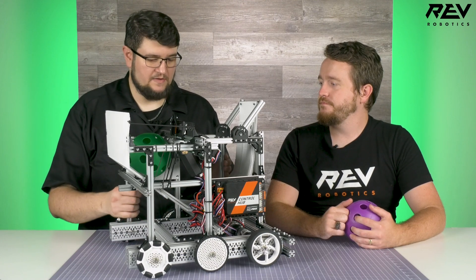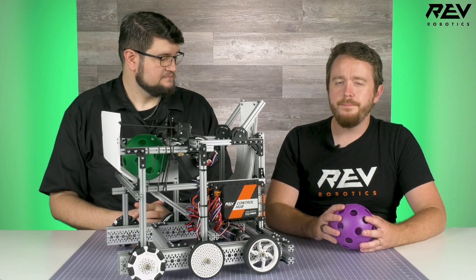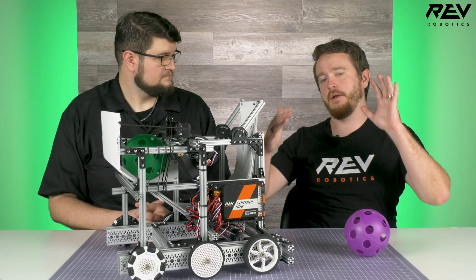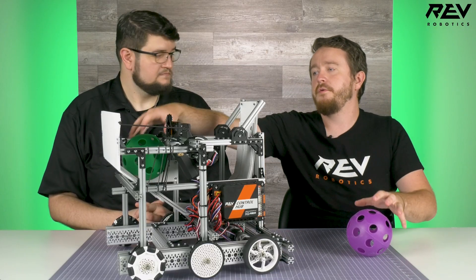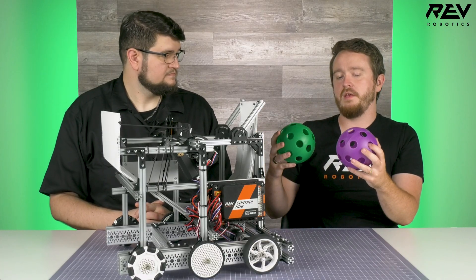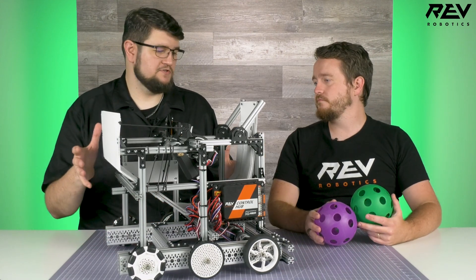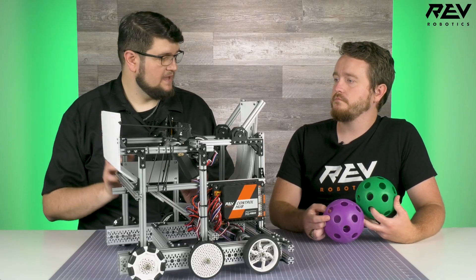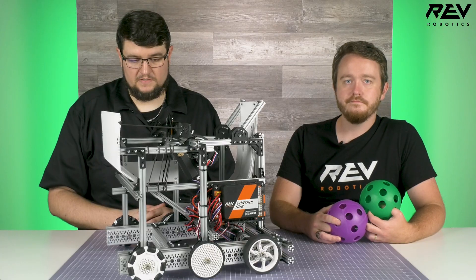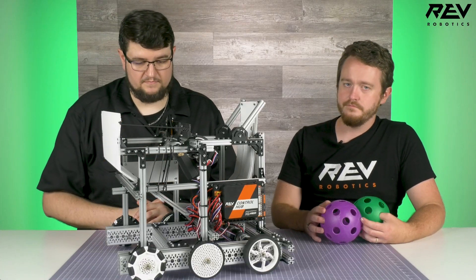The biggest challenge when building this was serializing the game pieces. Even with a chute and a hopper that only allows one game piece to sit next to each other, they really like to stuff themselves in ways that are hard to get unbound. Keeping game pieces in a controlled format is probably going to be a difficult but worthwhile challenge. For teams that don't have corrugated plastic, I'd recommend polycarbonate as a really good replacement — it's resilient, clear so you can see the color of game pieces from a distance, and easy to make a consistent arc with.